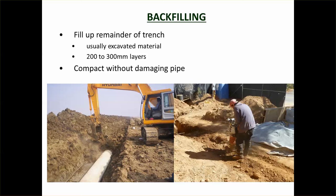For final backfilling, the excavated material piled alongside the trench is typically used. With an excavator, it's placed back in layers of 200 to 300 millimeters to ensure proper compaction over the pipe. The backfill must be adequately compacted but not so heavily that it cracks the pipe — so it's often done with light hand equipment such as jumping jacks or plate compactors.